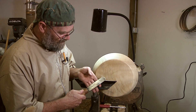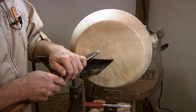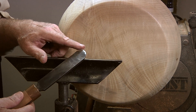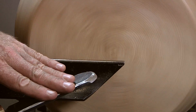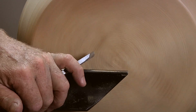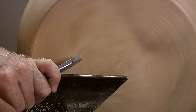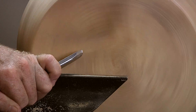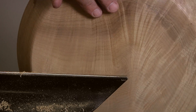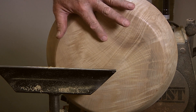This is going to be another finish cut. This is frequently called a shear scrape — I don't consider it to be much of a scrape, but it is a shear cut because the tool is going to be up on its edge. This particular one, I burnished a burr on it, and I'll go into more detail on that in the sharpening section. This is going to be a very gentle pull cut, and I do round over this edge so it slides easier on the tool rest. It will take several passes to remove the marks. This does give a very nice finish — there is still very minimal tear-out, but most of that will vanish with like 120 grit or so.